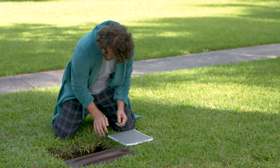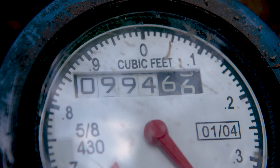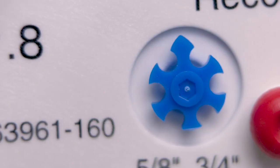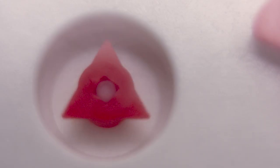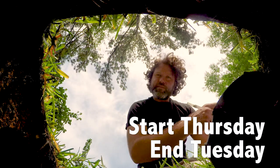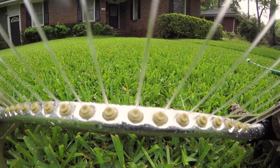Write down all the numbers on the meter counter — the numbers in white, the whole numbers, and the numbers in black, which are decimals. Make sure there are no leaks by checking your leak detection sensor. Your five-day test should start on Thursday and end on Tuesday to include the weekend. And remember, no outdoor water use.